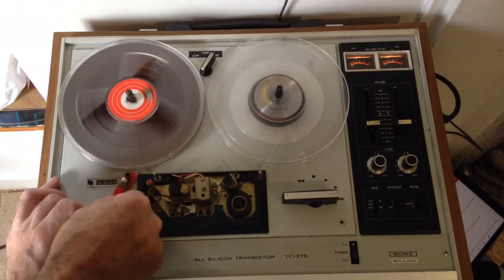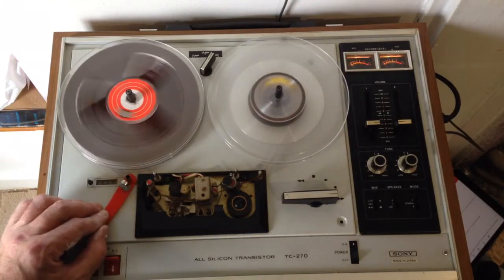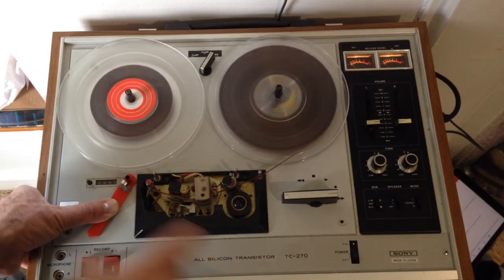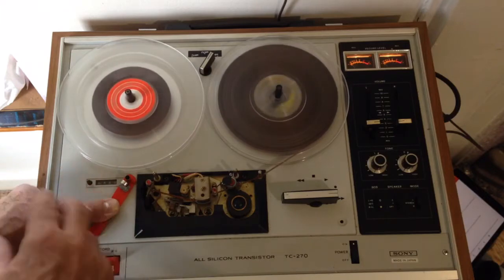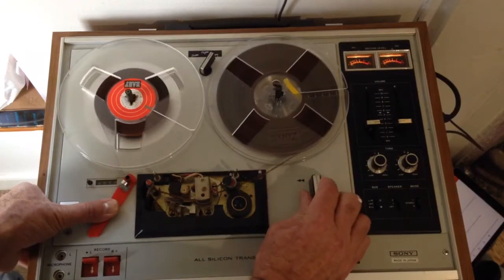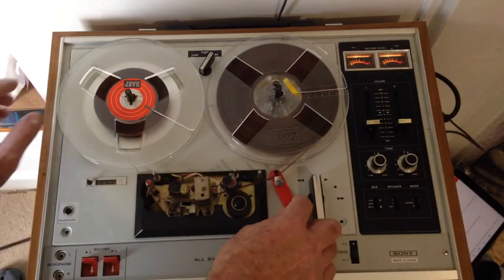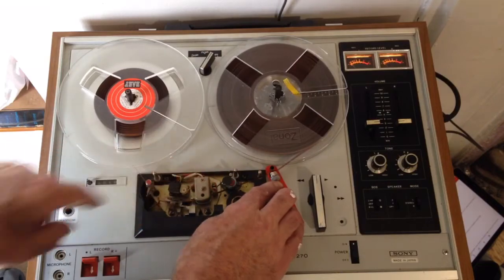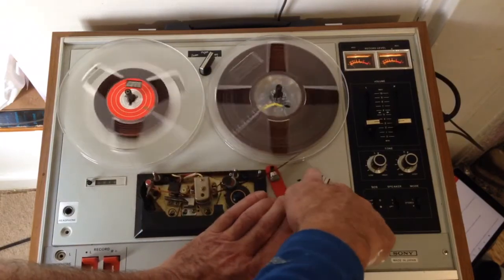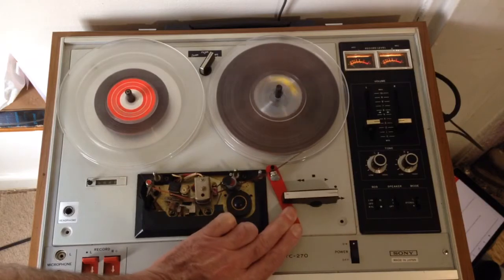Let's put it in fast forward — and I'll just pull that back a little bit because the brakes need sorting out on this reel, it's a little bit sloppy. But that looks good — it's coming over the pin and I'm sure that's blanking it nicely. Right, I'll be back in a minute when it's nearly done. It's at about this point that I like to stop and change sides, because this angle is becoming quite steep and it seems to put a stress on the tape — it would probably snatch if I wasn't holding it there. Now that's gone through to that point, that section has already been erased, so I'm pretty sure that's okay. Just go through the motions again, take up the slack, move that a bit so that the lever will go over it in the fast forward — and we're away.